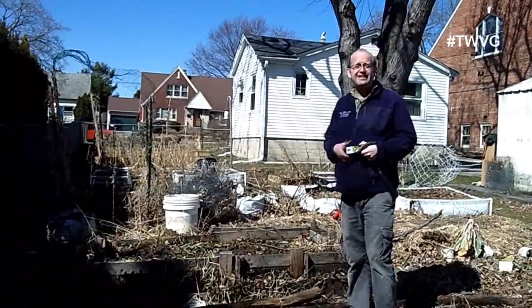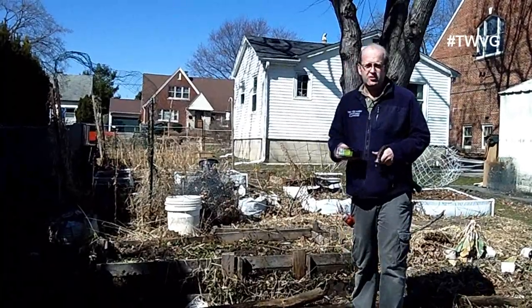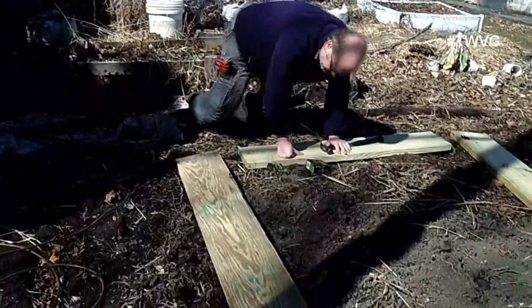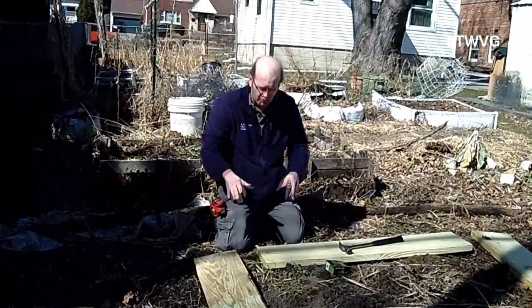With those up there, we did 6-inch ring shank nails, which was major overkill. So 4 would be the max. 3.5 here works just fine. So let's get putting this together. Now this ground is very uneven. Not a problem at this point.